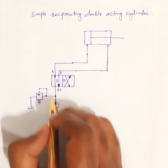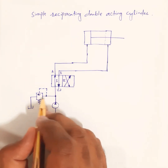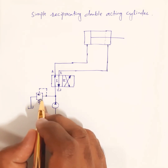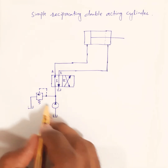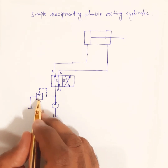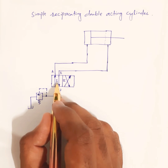So the pressure in line A will increase. The relief valve senses this pressure via the pilot signal line. As the pressure increases, the relief valve opens and fluid from the pump goes directly to the tank through the relief valve. This completes the operation in the first position of the direction control valve.